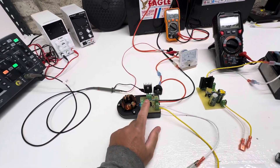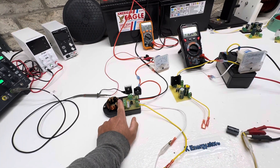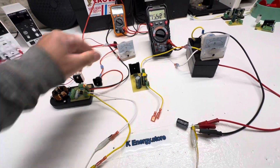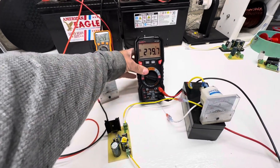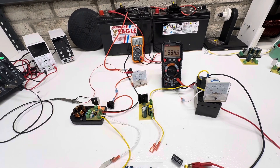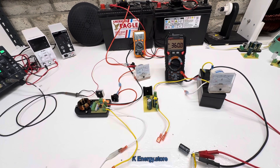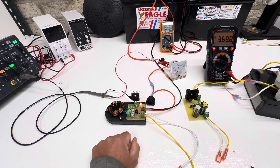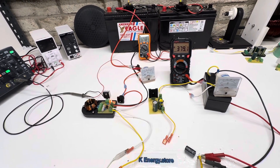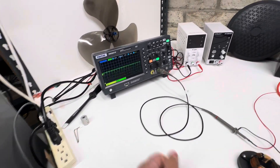On this oscillator there's a neon light that helps protect the transistor. Whenever the voltage goes over 80 volts, this neon starts coming on. Let's turn this on and watch the voltage here. It goes up pretty quick and you can see that neon. The higher the voltage, the more power is getting dissipated through the neon, as I have a 470 ohm resistor in series. As we start getting up towards 400 volts, there's a lot of power being dissipated, and you can see it on the scope.